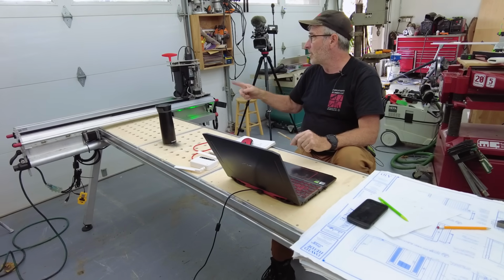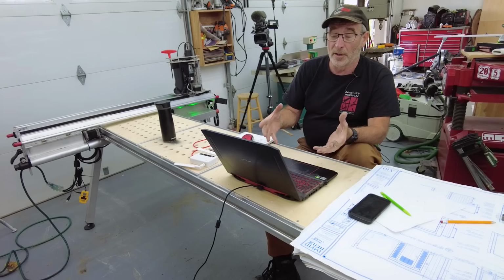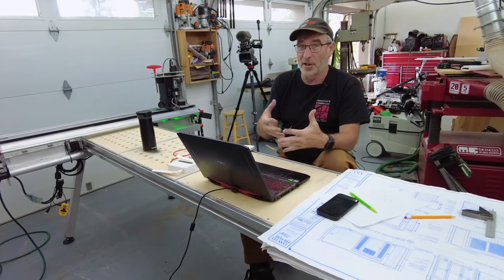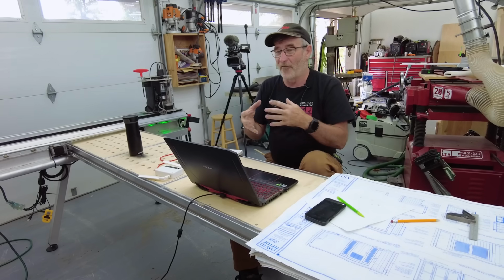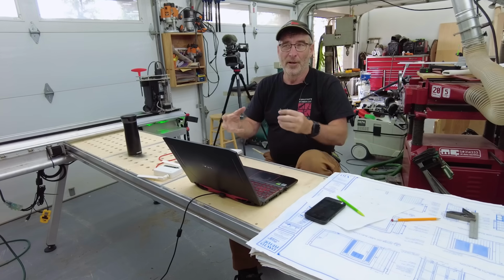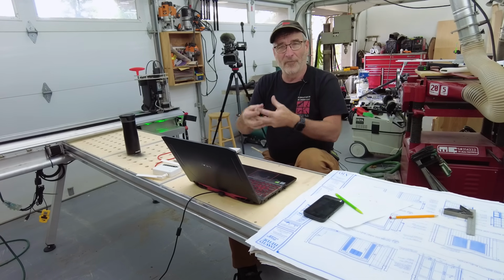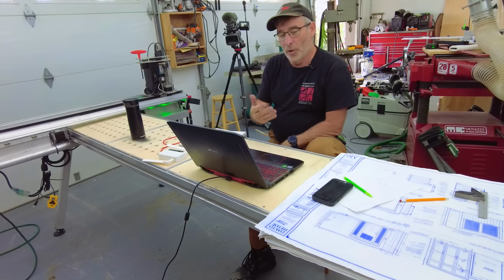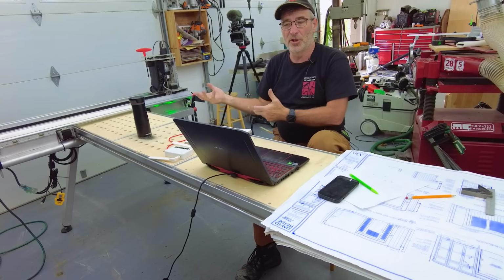A couple other things that Yeti has come out with fairly recently, and nobody else is doing it, is if you are familiar with CNCs, usually the software is your challenge. Sure. And in that is your feeds and speeds. How fast is the machine traveling across the bed? How fast is the spindle turning? You don't want to burn. You don't want to have sawdust. You want to have big, fluffy, beautiful little curls coming up off your wood that you're cutting, and getting that dialed in can be challenging without overloading the machine.